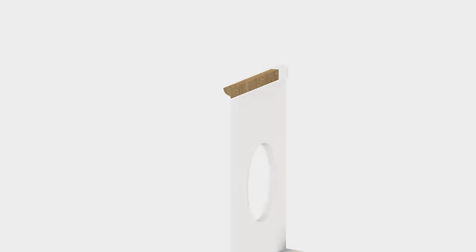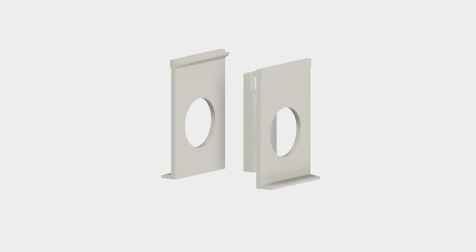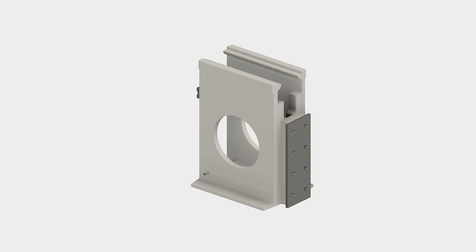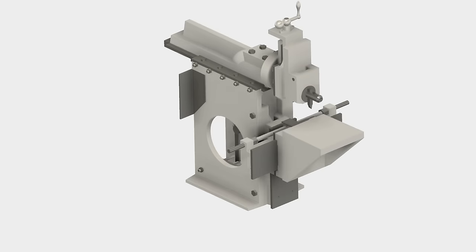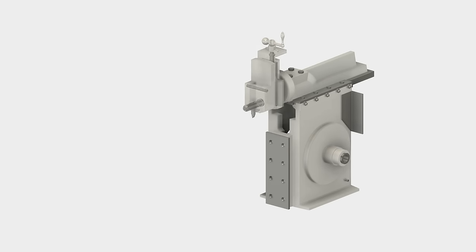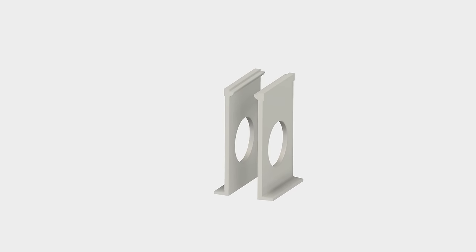The first thing that I did was to make a split pattern for the column sides. I used that pattern to mold and then cast the two column sides. Later, these two parts will be attached to the column front and secured in the rear with upper and lower spreaders. The vertical slideways are attached to the front, and this forms the column. The ram crank assembly is mounted inside the column. The ram assembly is mounted on top of the column, and to that is attached the rotating head with downfeed mechanism. The work table and slide gets mounted to the vertical slideways. This represents about 80% of the components that need to be modeled in the shaper. There will also be an automatic feed and drivetrain to which the motor is attached. In this video, we'll only be focused on casting the column sides.